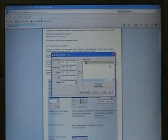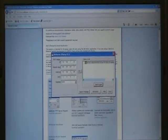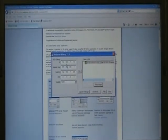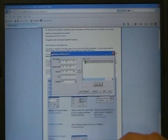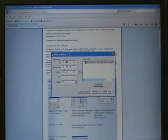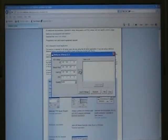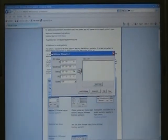This is our VR-Link and there is the current IP information — this is the default information that every VR-Link is set up with. Here we can change the IP. If we want to set it for DHCP, then we set all these values to zero. If we want to just change the information, we write in the new information. Let's change it to 200 and hit Set — and that changes the IP information for the VR-Link.